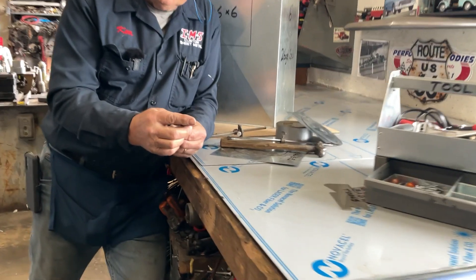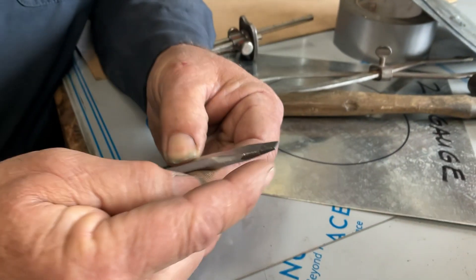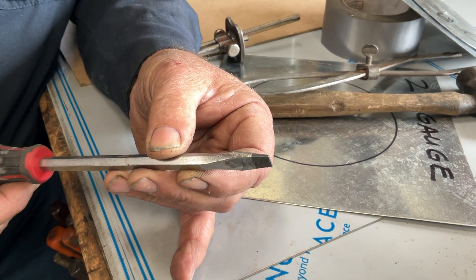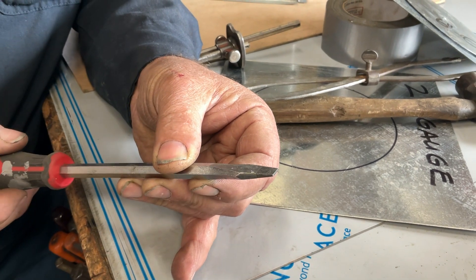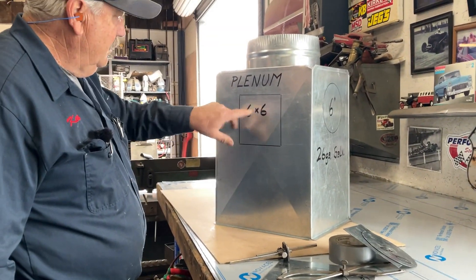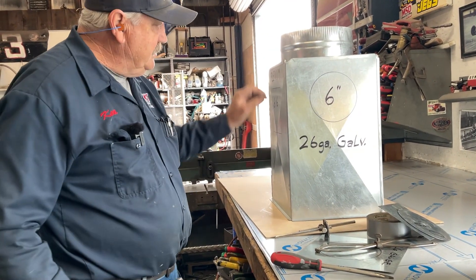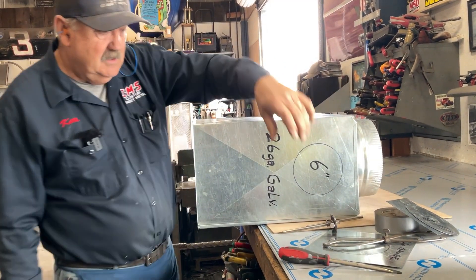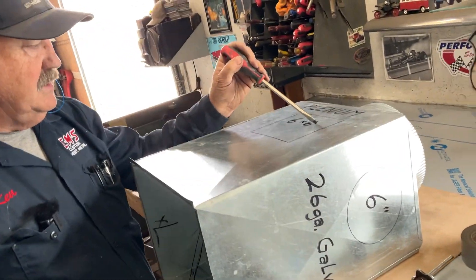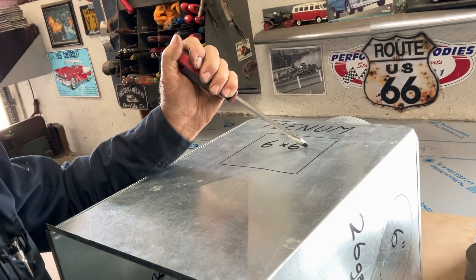A lot of the parts we use in HVAC are made of sheet metal. So I like a screwdriver — number one, it has to be pretty new because it's got to be sharp, and I like the ones with the squarest corner possible. There are several brands that have this same effect. So what I'm going to show you is we're going to go out into the field and cut a hole in our 26-gauge galvanized plenum. We take our screwdriver — the screwdriver with a nice square corner — and I'm holding it at an angle with one point on the sheet metal.